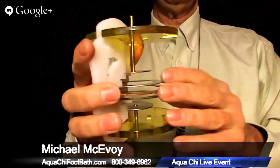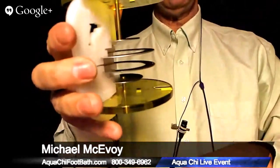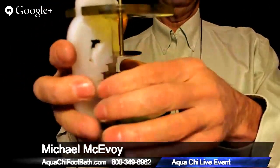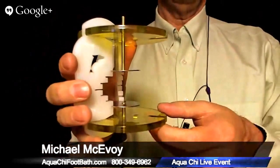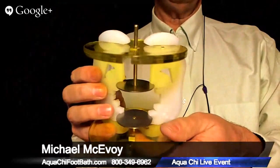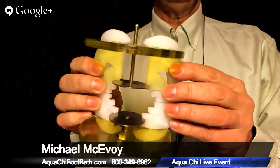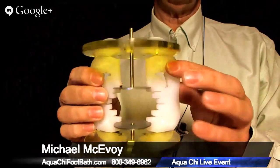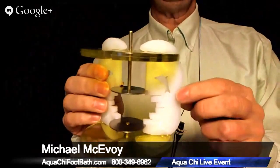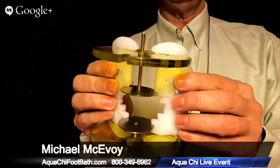So now, in order to get at the posts, we do need to remove the center rings. So take out your copper ring and the large silver rings on either side of the copper ring. And now you have the module with just the post set. Now, what's good about this setup is that you still have two legs holding the module together. It can be a real puzzle if you take the entire thing apart. It's not that you can't put it back together again, but this is going to be easier if we try to keep a couple of legs in the module while we're doing this procedure.